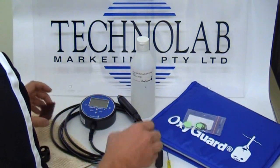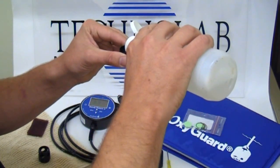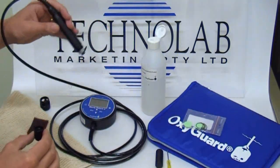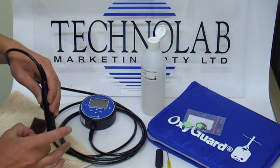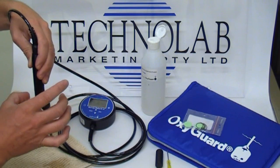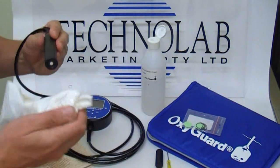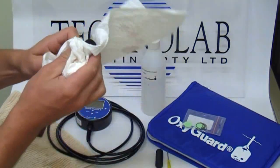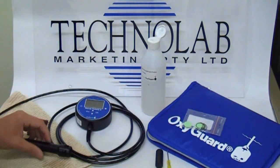The next step is some electrolyte — generally fill the cap two-thirds to three-quarters full. Take the probe and give it a few turns. Flick the side of the meter to get rid of air bubbles; it does breathe quite easily and will drip out the excess electrolyte. Screw that on quite firm. The membrane is actually quite robust. Dry the membrane and make sure the probe is on nice and tight. Fit the membrane cap protector — and that's done.